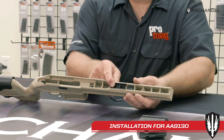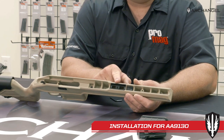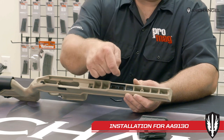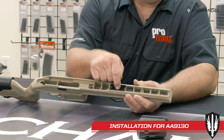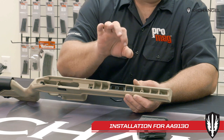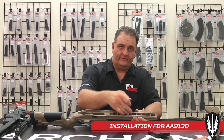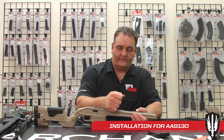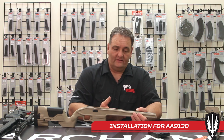The plug I mentioned has a screw in the center of it. Some Mosins have a dovetailed rear sight dovetailed in the top of the barrel — with those type of sights, you leave this plastic filler plug in place. With the Mosins with the banded rear sight, that screw comes out and this little plug comes out, and that clearances for the band. So if you have a banded rear sight, take it out; if you have a dovetailed rear sight, leave it in.